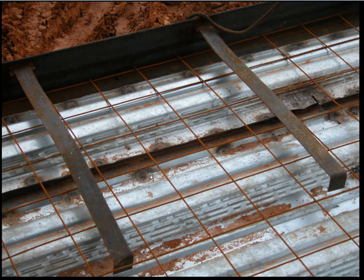Here's a perimeter situation where there is a beam along here. These welds are to the edge angle, so the concrete is cantilevering from there out to there — about a foot and a half. You can't carelessly cantilever it that way because the concrete will be in tension at the top of this slab construction, and also the steel corrugations are not running in the correct direction. Notice these straps that come back with a hook on them — those straps create the tensile capability to allow this foot-and-a-half cantilever to occur beyond the beam, providing tensile steel near the top of that slab.